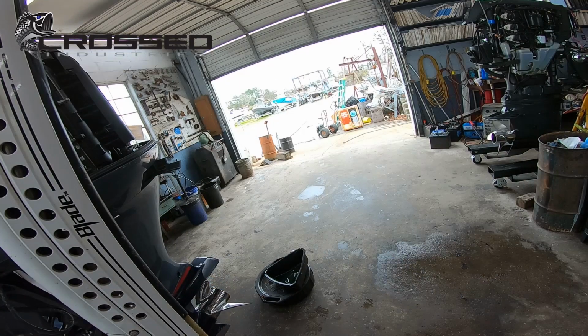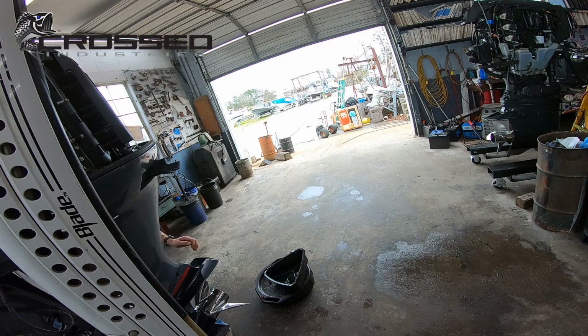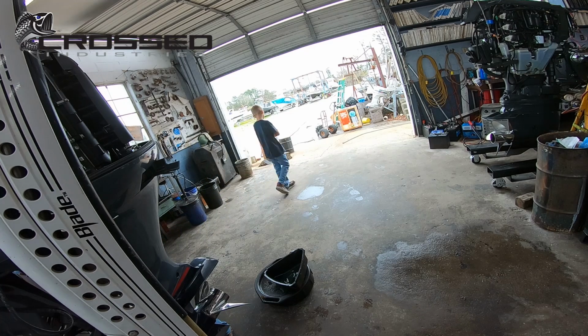A little bit. Now, this is where you're looking and checking. If there was a big air bubble in it, when I pulled it, I'd sling 2 or 3 inches each way. And if you're steering, normally you would turn it a quarter of a turn, now you're turning half a turn to make the boat maneuver the same way.